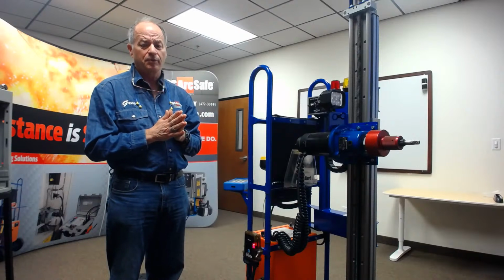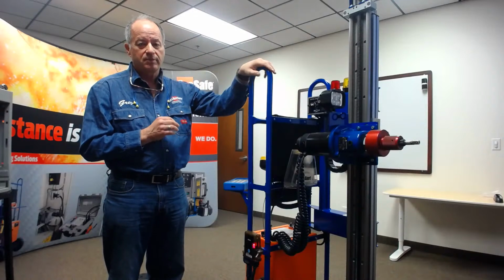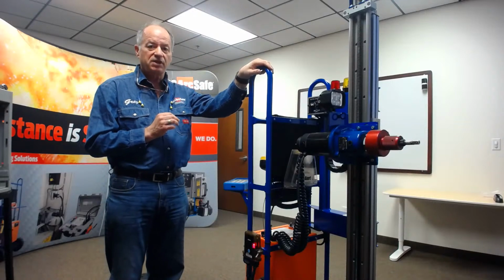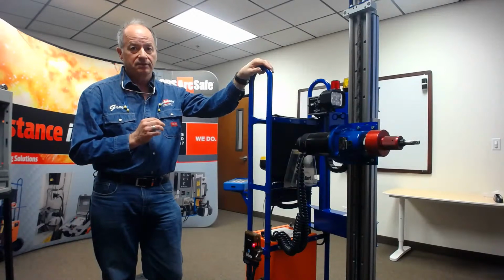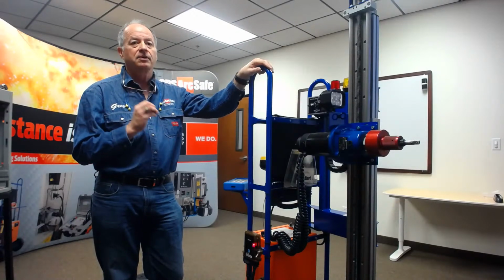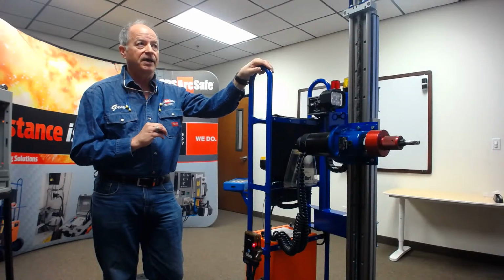Our sister company helped them come and clean that off. And we watched the force on some ABB HK1000s go from 70 foot-pounds required to rack a breaker down to 27, just by cleaning up a misapplication of lubricant on the rosettes, on the finger clusters on the back.